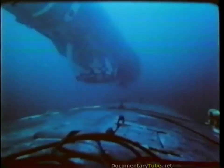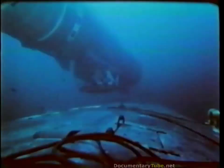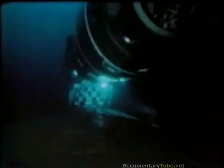The mission moves into the rescue phase and the DSRV returns to the disabled submarine for mating. The final approach to the submarine is made with the shock mitigation ring lowered. The DSRV hull withstands an impact up to 85 one-hundredths of a foot per second, but the shock mitigation assembly withstands impact up to two feet per second. The vehicle sets down on the hull of the dis-sub, then the manipulator clears the hatch — first the messenger buoy cable is cut, then the manipulator's water jet clears any debris from the hatch area. Mating begins with the DSRV aligned to the hatch and with the shock mitigation ring extended. When centered over the rescue seat, the shock mitigation ring is retracted and the dewatering pump in the skirt is started. As the water is pumped out, a pressure differential is created, pressing the DSRV against the sub and ensuring the seal.